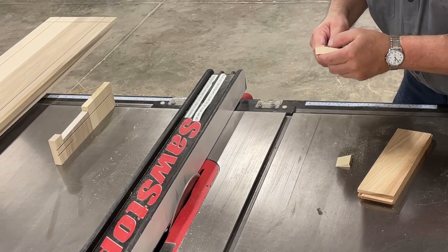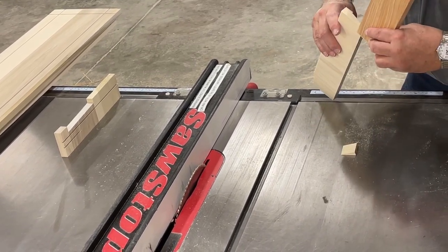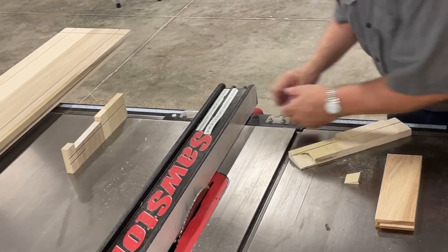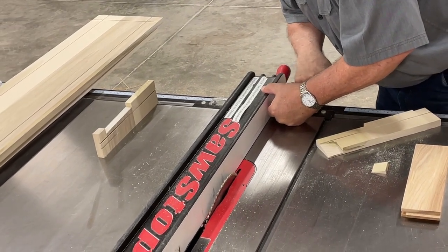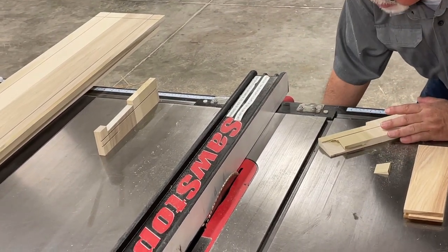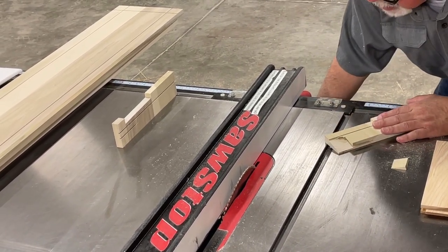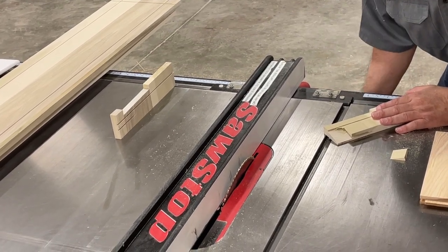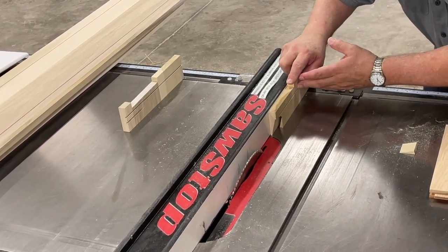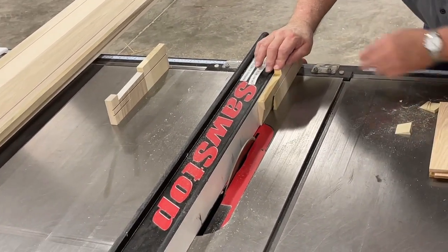Well, I think my 14 degrees is okay, but I think I might be too close on my fence. You know, actually, I'm not even going to move that back more than just a tiny little bump. I'm going to take my saw blade just a shade higher, not much, because I need to cut through that flat spot on my kerf cut, but I'm going to leave my angle at 14 degrees. So let's see where we are here now. Okay.